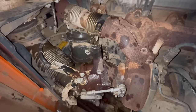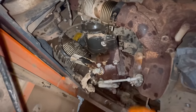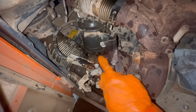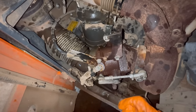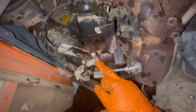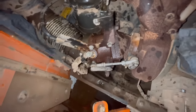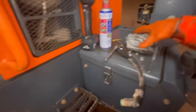That's what it looks like removed. A bit of coolant about but I haven't lost much — I'd be lucky if I've lost a cup full. There are three bolts here you can remove to take it off the bracket, and this bottom one you're doing blind from behind here — it's a bit of a fiddle, but that's the way I do it. Because if I try to take the other route, I'd need to remove this sensor, and that'll be hot and cold, hot and cold, expanding and retracting — there's a chance the threads might pick up. So that's why I do it that way.